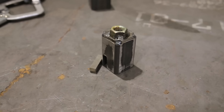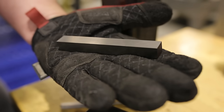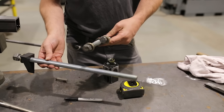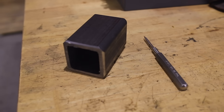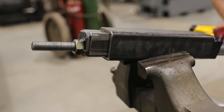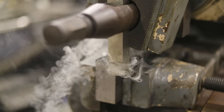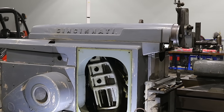I want to show you the tool that I made to remove that pesky weld out of there. You need a piece of high speed steel, a piece of all thread, a few nuts, an end cap, and the slug material itself. We're going to drag this piece of high speed steel through the inside diameter of the tubing, much like how a shaper works. If you're not familiar with a shaper, I have a video on that — it's pretty interesting to watch.